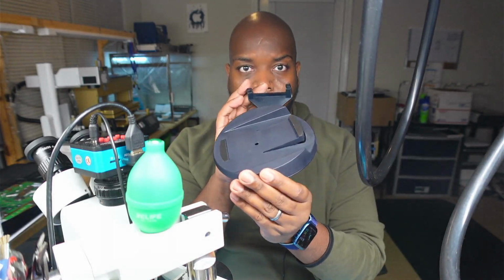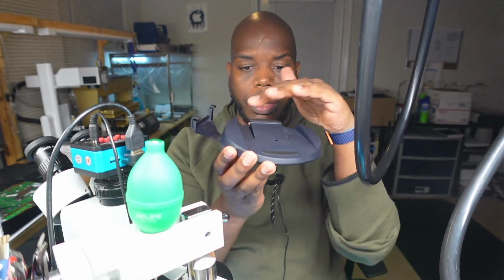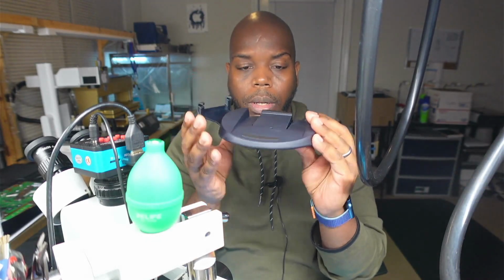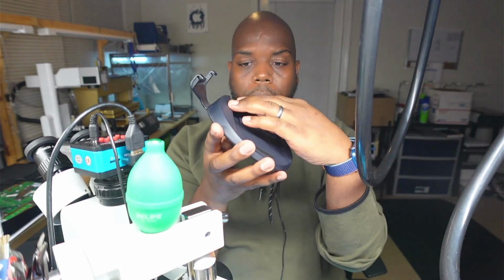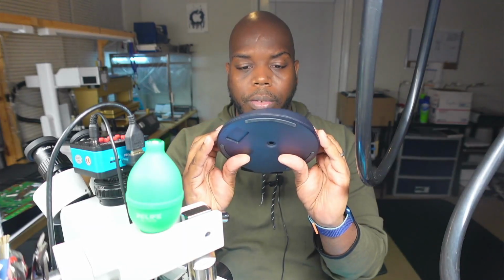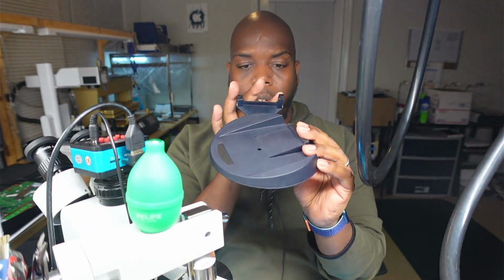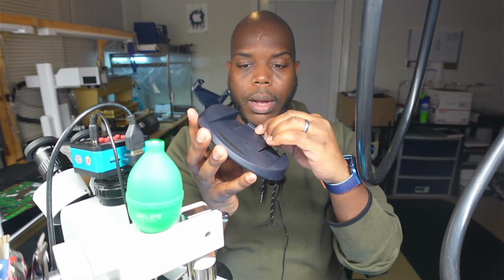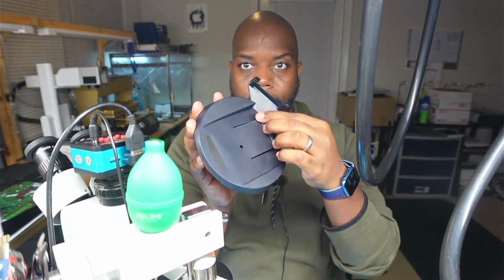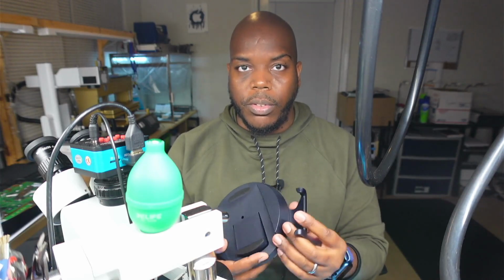I think what's really going on with these PlayStation 5s is that we have this little clip on the back of the PlayStation 5, and when the customer or the user is using the unit, it tends to slide forward over time. If you don't install this properly, I know you have to connect this between the triangle and the square. In the back, there's kind of like a pattern where you have to adjust the alignment. And this thing right here has a bad tendency of just sliding off. I mean, I'm barely tapping this, and look how easy it is to slide. So it's supposed to be locked in place once it's set. You know, you're supposed to set it and forget it.